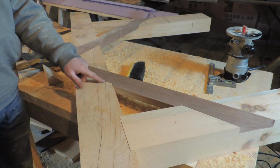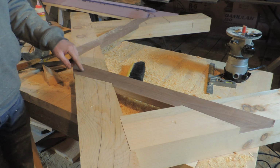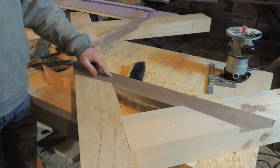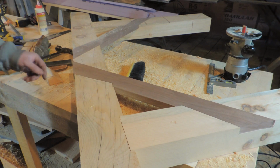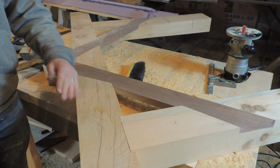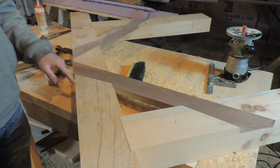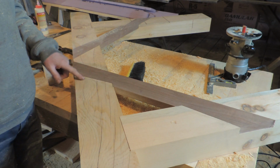Any little spot where it's not tight, I'll take the sawdust from this. Like I said, I don't know a single woodworker that doesn't do it. You make your own wood putty to match this walnut. You save the sawdust and mix it up with wood glue. You fill it in there nice and it does a really good job. It's very hard when you're going dark wood against really bright wood. Any little mistake in that fit up is going to show.